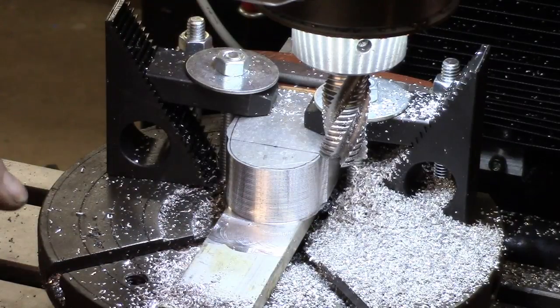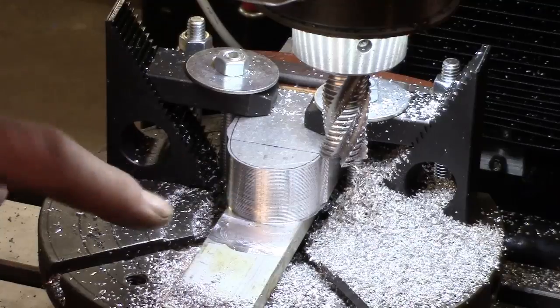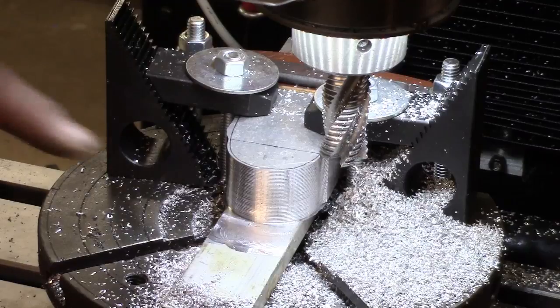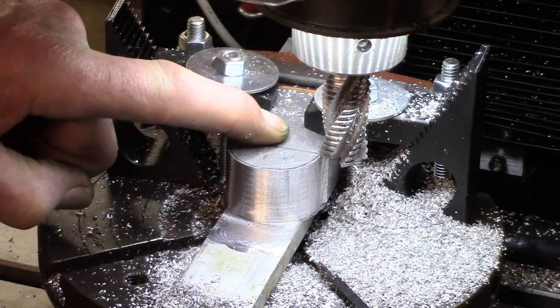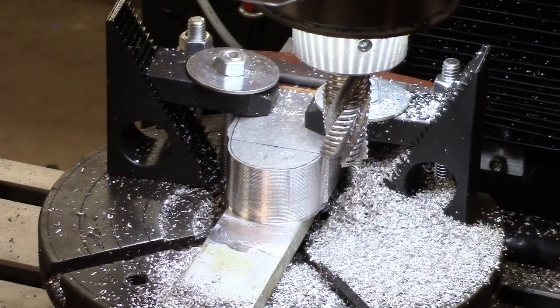Clamps and stuff that I could manage — I've got four T-slots but they never seem to be in the right place. So I've got the material removed. I could possibly have set up the bandsaw and nipped off the corners, but this was an experiment really. The basic thing here is getting rid of the main amount of stock, leave myself a guideline, and then we've got to drill it, fit it to the butt, and then see what we've got left to take off. First time I've tried doing this — it may be very obvious.